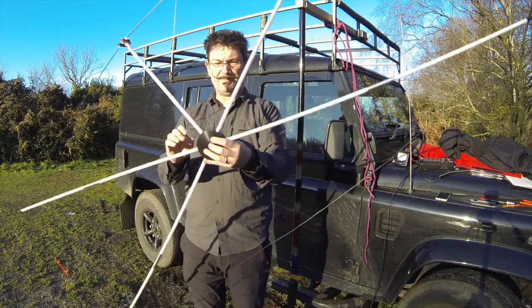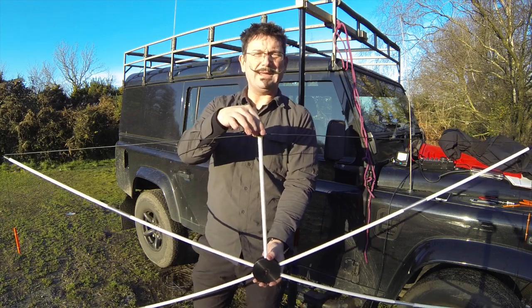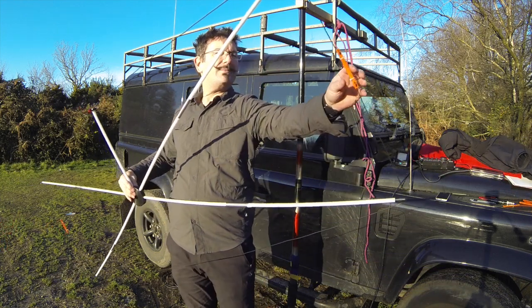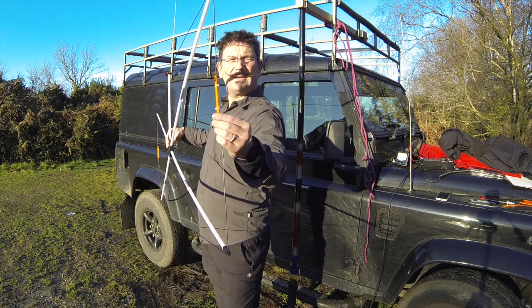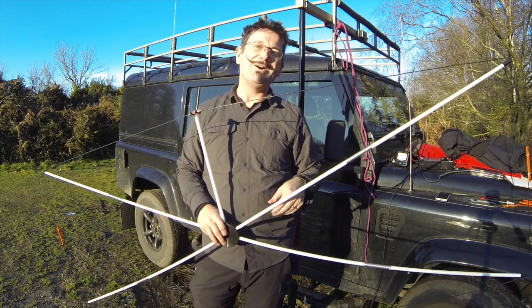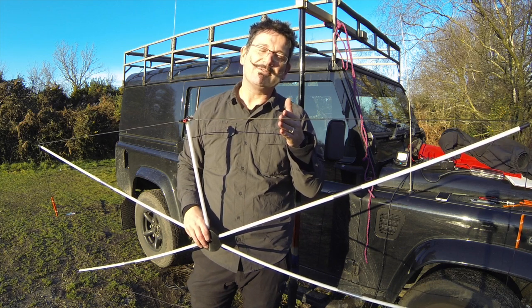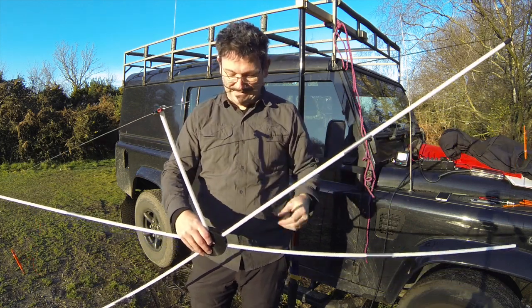This is the finished piece - the universal hub, and this is the front connector with the binding post. It's a BNC female on there so you'll need a male plug and balun on the end of your coax. Those are the little separators, with cables cut to the end and aligned with the score marks on the separator. One important comment about cutting the cable to length: make sure the inner conductor is actually aligned with the end of the insulator. When I cut my first one I realised the conductor was some distance inside the insulator - fortunately I had plenty of spare cable so that wasn't a problem.